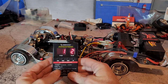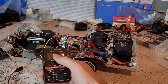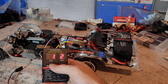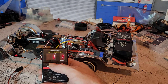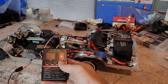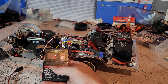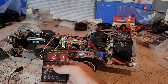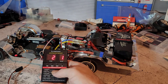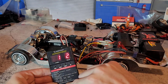When making adjustments, it's very easy. When you're on the numbered item in the list, you use the value button to change the selection. Once you've chosen what you want, press okay — it sends it into the program box and into the ESC. Then move on to the next one, change the value to what you need, press okay, and move on to the next.